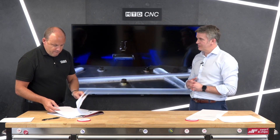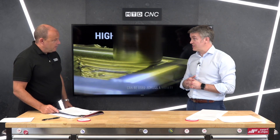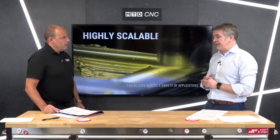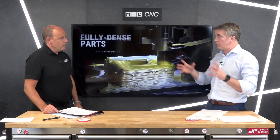You mentioned aluminium, and in my notes we're talking about various materials: aluminium, copper, steel, magnesium, titanium, nickel alloy, bronze. Absolutely — you can do this with any material. Those are the materials done so far. Over in America they've been working on titanium 64 with success, though that requires shielding. All the rest so far have been done in open atmosphere.